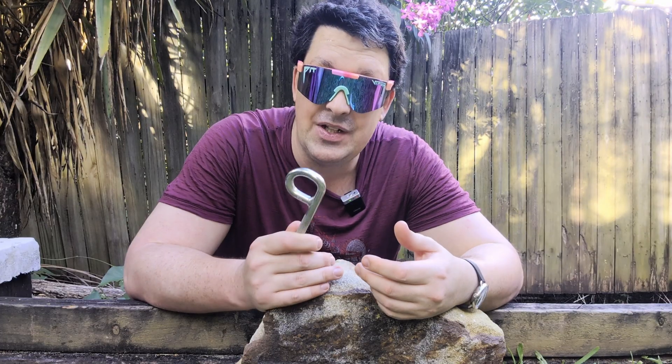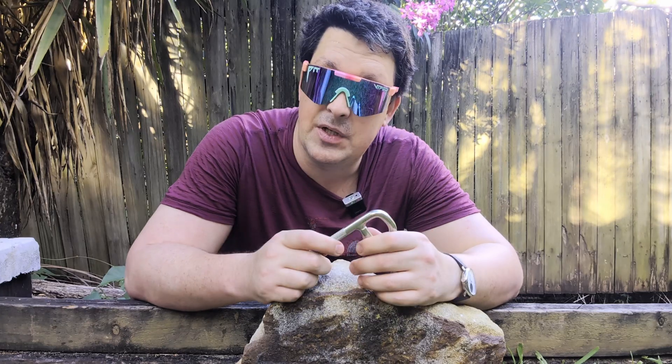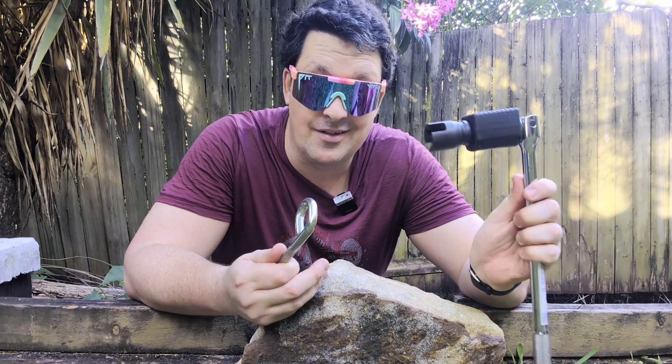So it seems a little unrealistic to expect almost double that out of a 10 millimeter bolt. But I'm sure they put it in the standard for a reason — maybe because torque is something that's a lot easier to test than tension, because instead of a big hydraulic puller, you just need a torque wrench, and these are pretty common.